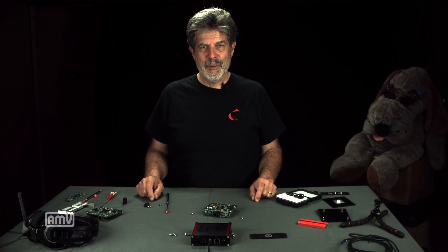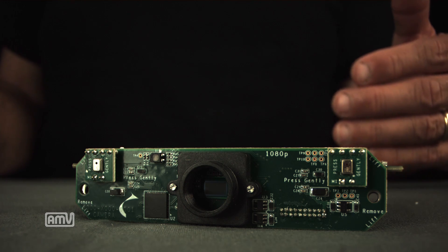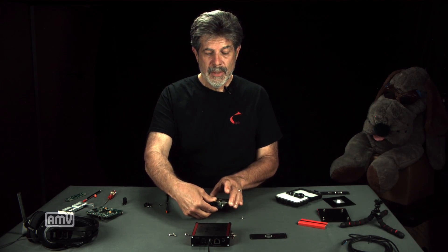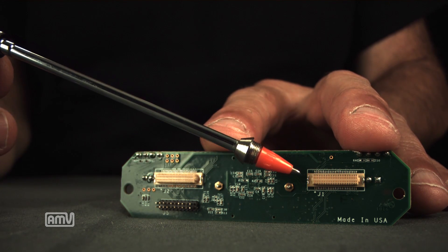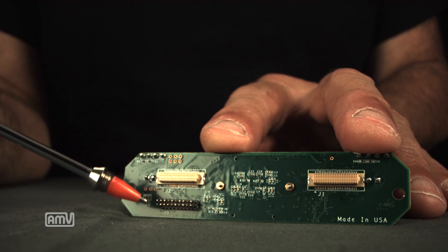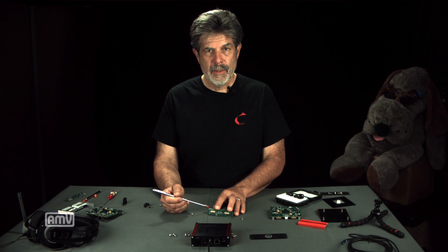One of the many aspects we built into this camera is the ability to swap the camera board itself. If you have a 1080p camera and want a 4K or a 720p because it has different characteristics, you don't have to buy a brand new camera — you just buy a new camera board. On the back side you'll notice there are two banks of 50 I/O pins. These connect the camera board directly to the FPGA, and we also give you 20 pins of user configurable I/O, giving you the ability to add your own controls to the camera board.